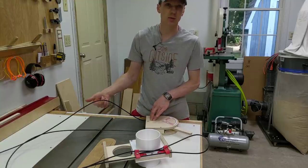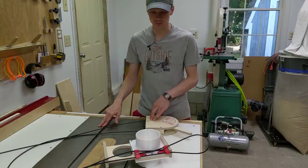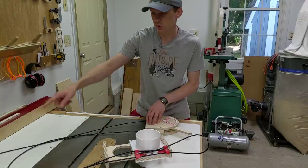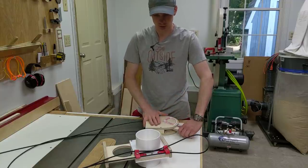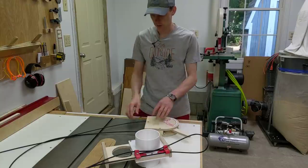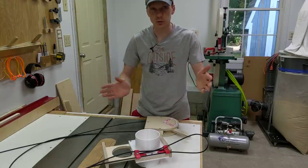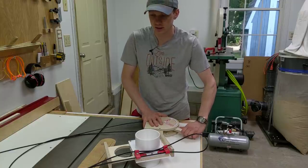These cables are the same thing that you'd find on your bicycle brakes or a go-kart throttle cable. They help transmit the motion over a long distance, and I can even translate from linear motion to rotary motion. With two cables, this pull-pull system is pretty basic, and there's nothing fancy going on inside this handle.